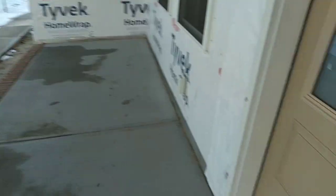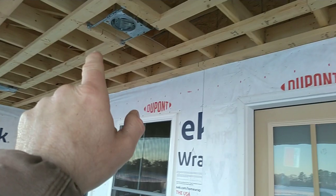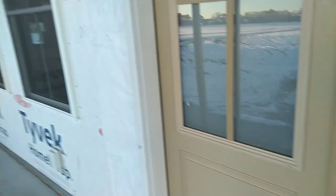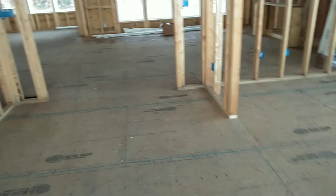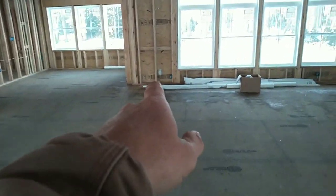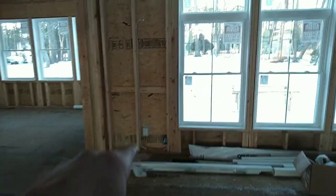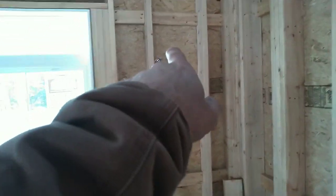Let's start at the front door. There's a two-third view double French door coming in. The customer opted for four ceiling cans right there, a doorbell on the right-hand side, and one outlet on each side of the front porch. There's a white box — that's an outlet for the back deck area. They opted for two lights through the back wall, one there and one there.